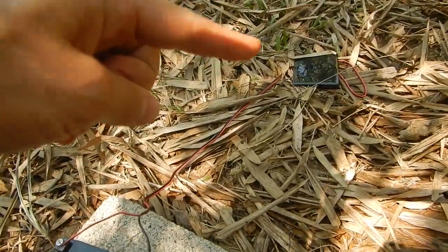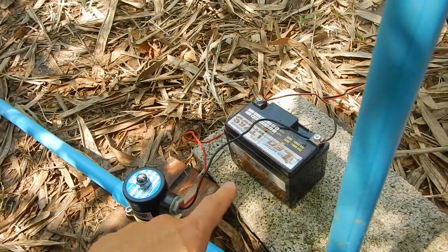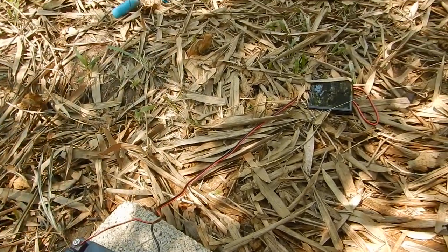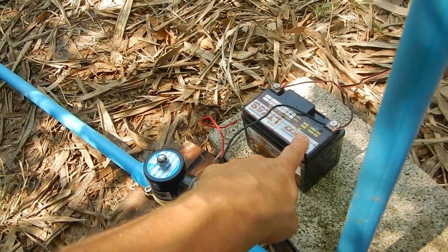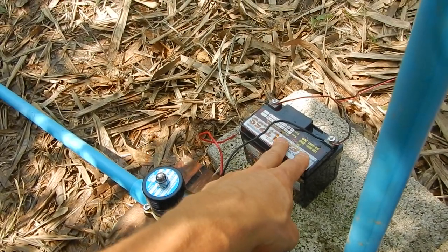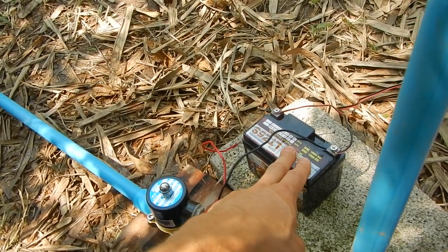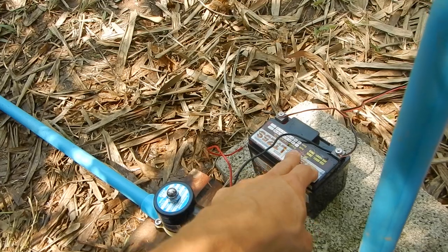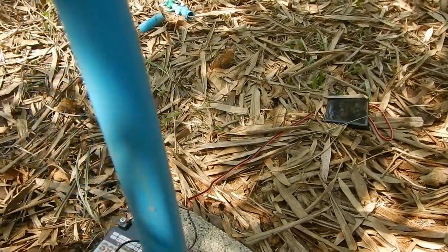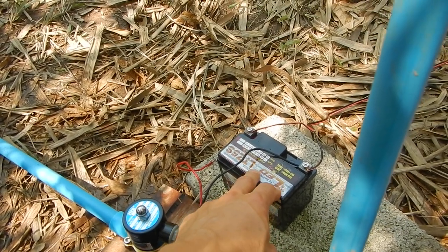I might need a charge controller for that small solar panel to charge this gel battery — just a cheap motorbike battery, 12 volts. For now I think charging through a solar panel like this should be okay, but the bad thing is that the max voltage is 14.1 to 14.3, so I wouldn't have it charge more than 14 volts. Right now I can get it to like 13.5 to 13.6 volts, but I want to test charging with this little solar panel. If the voltage gets too high, going over 14 volts, I would need some kind of device to limit the voltage coming from that little panel.